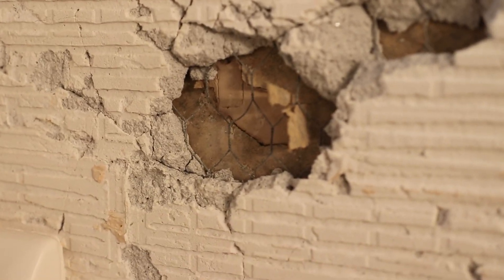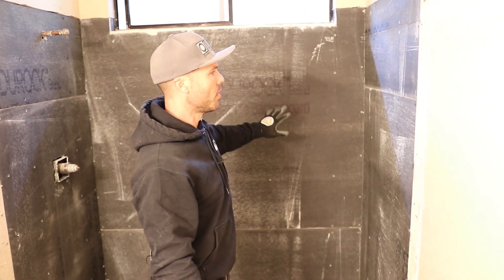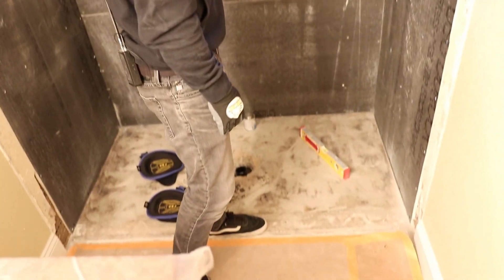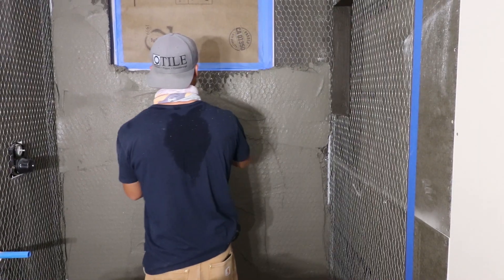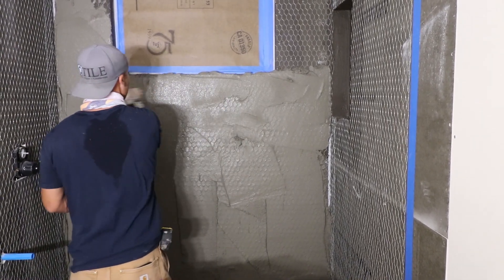I found out a lot about this project, and I believe there were two main contributing factors to the original fail. One of them was putting paper behind our one-coat float. What that does is separate the float from the wall, making it easy for that mortar to cure and bow off the wall because the only thing holding it in there is staples into drywall. We've gone away from the paper, especially now that we have DensShield and the Durock fiberglass mat reinforced panels, which are waterproof already. That way the mortar can stick to the wall and creates one solid surface between the wall board and the float — basically one inch of good substrate, as opposed to half inch max with paper, sometimes thinning to three-eighths or even a quarter inch in some areas. That's a very weak substrate when it's separated from the wall.